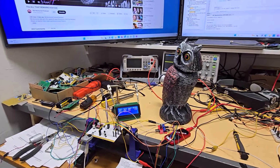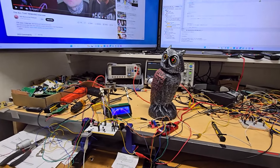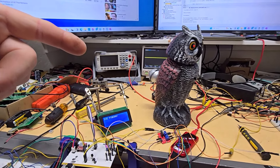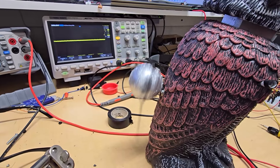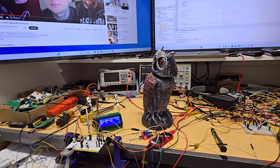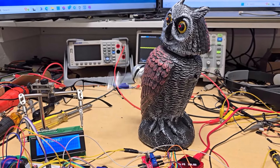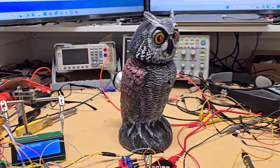I just added code that after it does the little head jerk, it goes over and pulses that motor a few times. I don't know if I'll leave it that way, but I'll quickly put it in the function so I can test it. I'm going to add some foil for looks, but right now it's just got that thing back there. If it turns it's going to kind of pulse - that actually sounds pretty cool. I have it on for 200 milliseconds and off for 400 milliseconds, so it's just pulsing. If that motor stays on it freaking roars pretty good.